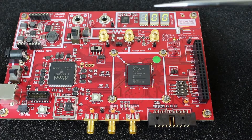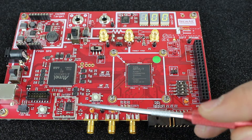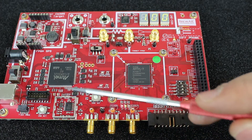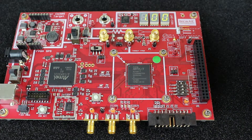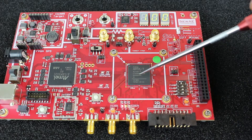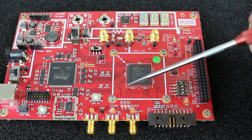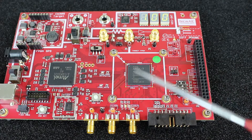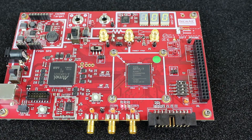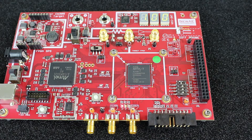There are a bunch of examples for that if you want to see how it works. There are also some clocks down here — this is a PLL chip that's programmable over USB, so you can adjust the running frequency. This is handy because you can do things like test an AES core at 10 MHz versus 100 MHz, switching frequency externally without modifying any of the clock logic on the chip. It's also useful for PUF designs — physically unclonable functions — to check behavior at different frequencies.